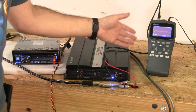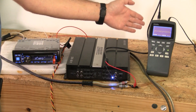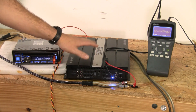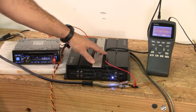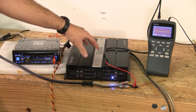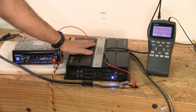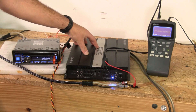An oscilloscope will not tell you the actual amount of power because that would require current to be displayed as well, but it will display voltage so we can tell what voltage we have along with our clean waveform. In a perfect world you would do this with a speaker load on it, because things can and will change with the dynamics of having a speaker connected. If you're going to do it unloaded you have to go off of the rated impedance spec for that amplifier — if you go below rated impedance, odds are it's going to clip before the setting you have it at.